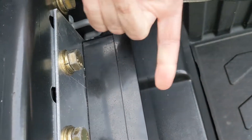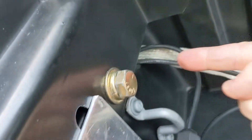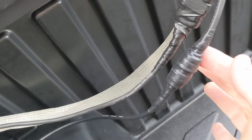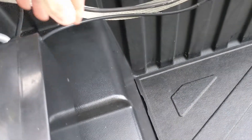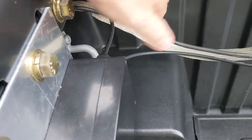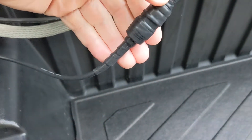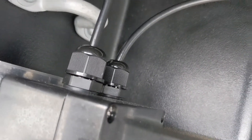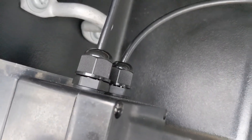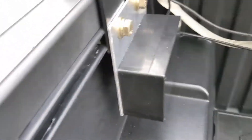Basically what I have is this box here with the toroid inside wrapped, and the cable comes in here. Behind this grommet is another cable gland attached inside the fender, then it's connected through here with an SO-239 barrel connector. On this end it was already SO-239 with a crimp-on PL-259. With the cable glands, there's no way water is getting in there at all — it's a fully waterproof box now.